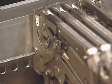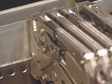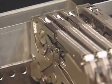Each tape feeder is designed in a support bracket system which allows automatic control according to the thickness of parts, eliminating the need to purchase separate feeders because of varying thickness of parts. The 8-millimeter feeders are designed to facilitate setting in 2-millimeter pitch and can handle micro 1005 chips.